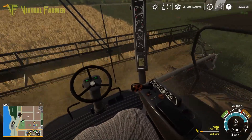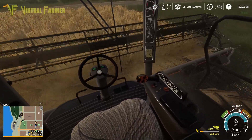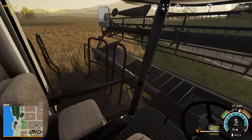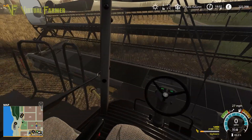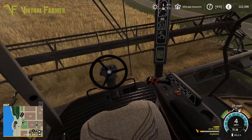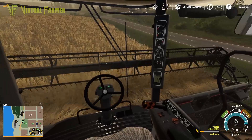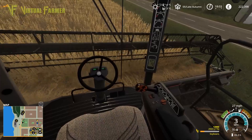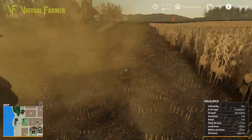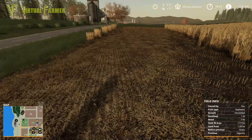You can see the comb here just teasing the tops of these soybeans onto the belt. This header is set up much more for soybeans than anything else, because if we're not careful with how we drop the soybeans onto the header, they shake out way too early. We want them shaking out in the thresher so we can contain them better. If they drop too heavily onto the belt, we lose a lot of crop — and you can see here, no losses in the trap, so that's good news.